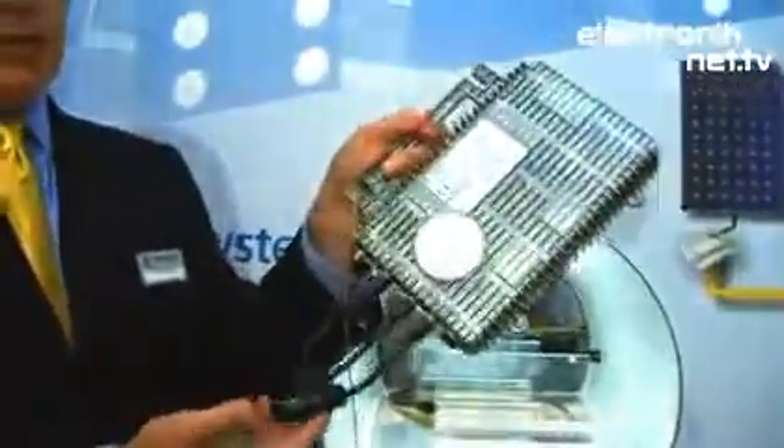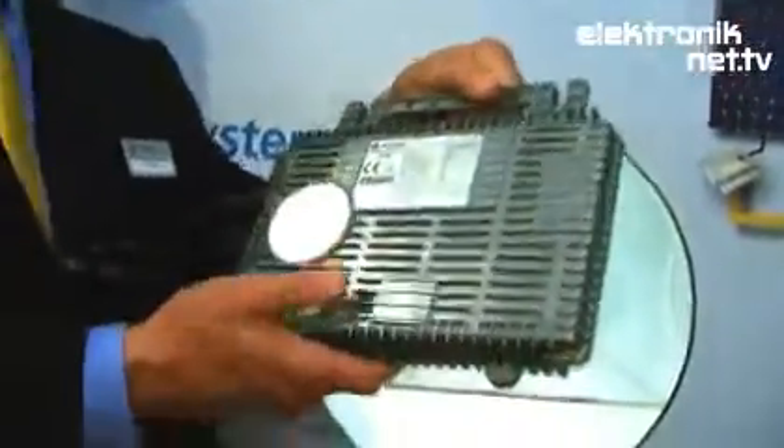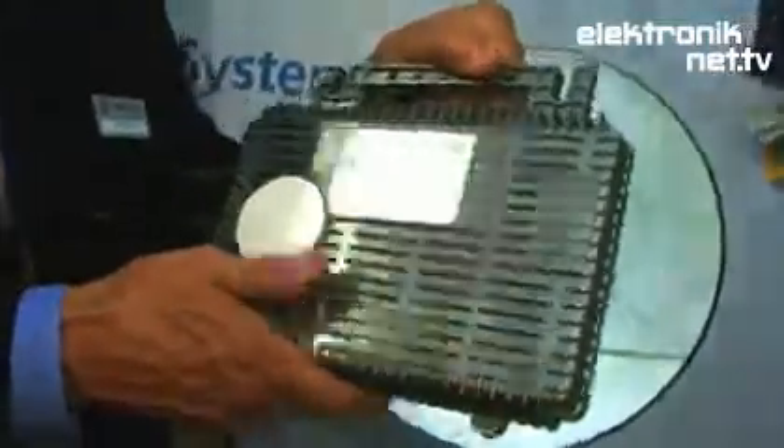For example, if it's a house, you'd have a central inverter in your garage, basement, or attic space. And that's one of the huge differences. With our system, there's only an inverter with each solar panel — like here — which is just a small unit that has two DC connections from the solar panel, mounted on the frame that holds the solar panel up.